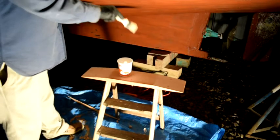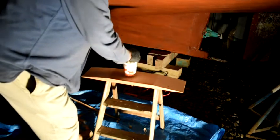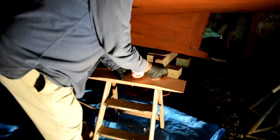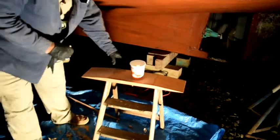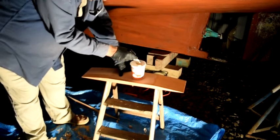Now I'm just going to go do one more test fit to make sure this really is good, and then I'm going to get the epoxy out. Now that everything fits I'm ready to do the actual installation. Like I did with this piece, I'm going to start by painting both scarf surfaces on the plank and on the boat with unthickened epoxy, so that epoxy will not soak in from the thickened epoxy that I'll put in here. Just paint it on there — I'm being fairly liberal, because I'd like any epoxy that's going to soak in from this application.